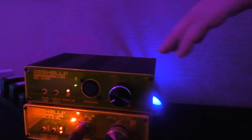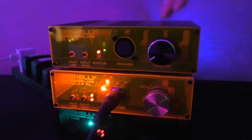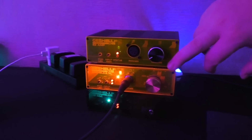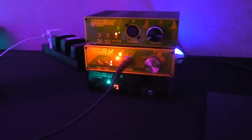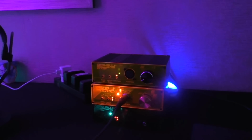Oh, I love it. And you have the board stuffed for you? No, we make everything in-house. So, everything? Yep, so we get a 12-foot extruded aluminum bar that's cut with a jig. And then that goes to our sandblaster. We sandblast in-house, powder coat in-house. The actual PCB circuitry is by us, circuit board population by us. So we have 2 pick-and-place assembly lines. Goes through the pick-and-place, goes to the oven, goes through a 2-stage ultrasonic cleaning process, goes to me. Everything's hand soldered. After that, it goes over to our assembly line, which is Rachel, my sister, and I, and we stuff all the boards in the cases ourselves.